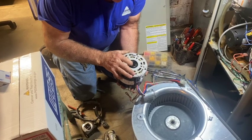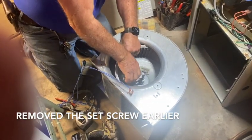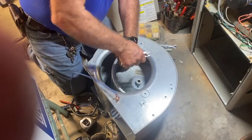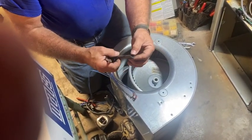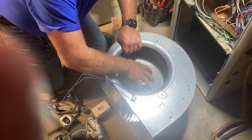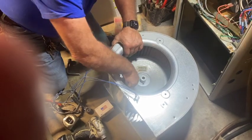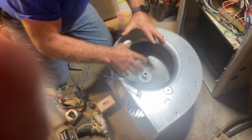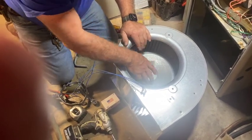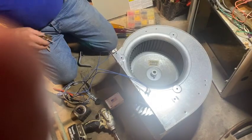In all these years, I've never had a motor fail like that ever. That's got to be a failure in the quality of the material that made that blower shaft. I want to verify and make sure that hub is nice and tight. It's actually just pressed to that inner housing, so there's nothing wrong there. A lot of times these fan blades will actually separate from the hub or the center housing, and you'll get rattling and hammering because those things are rattling up against the surrounding material.